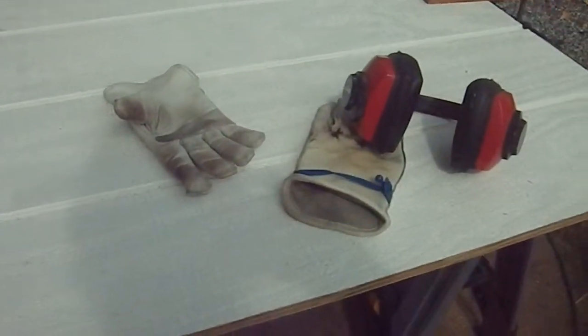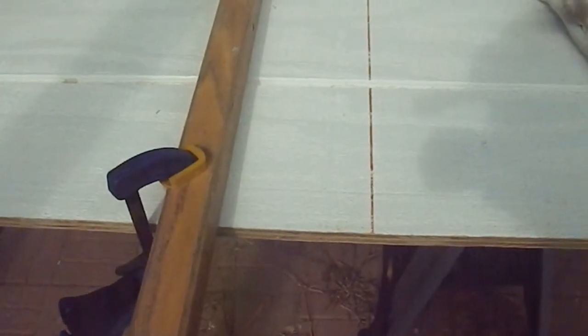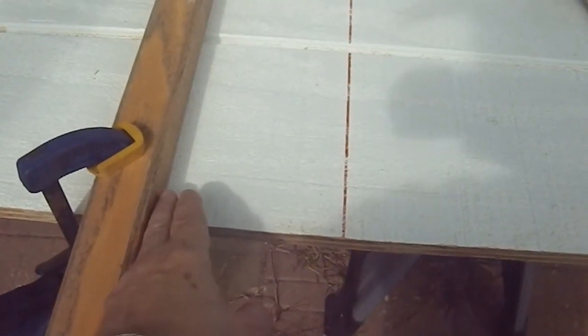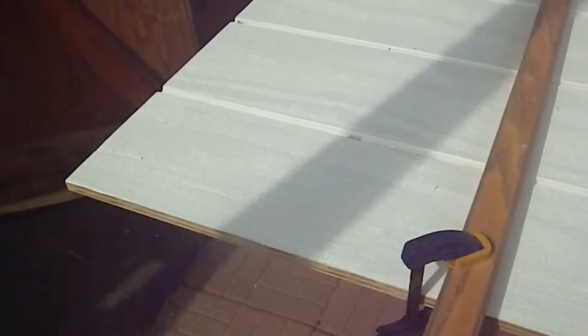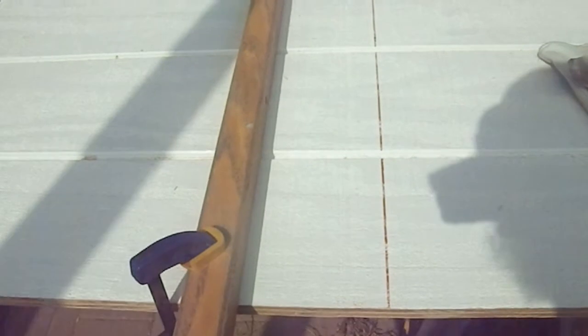So this is the piece of plywood I'm using and I've already cut the edges off. The cuts aren't perfect — I did it freehand following the grooves by eye — but they're close enough. For this cut I want it a little closer, so I have a straight board set up. It's a five-inch offset between the edge of my circular saw and the blade, clamped to a sawhorse. My wife is going to be on the other end to help me control it as I make the cut all the way across.